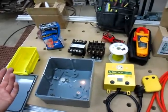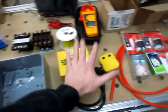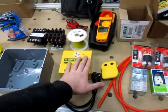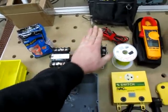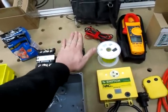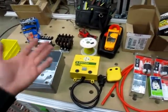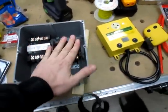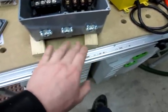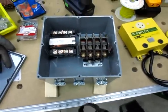I'm going to try and explain as best I can how to put this together. It's pretty simple — this is basically an on-off switch, remotely actuated, which powers our transformer, which powers our contactor, which actually does the switching. That's the overview of how this is going to work. The first thing I did was mount my contactor and transformer in the box, and I put three cable clamps down on the bottom so we have in, out, and our control.